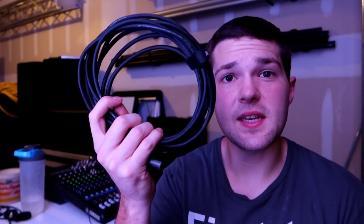Obviously, if you don't have fancy and expensive lights that already have wireless DMX built into them, then you need to go the other route — either DMX cabling, where you run wired cables to all of your lights. So I would run a wired cable from my Show Express box output into the input on this light. Now, there is a big downside to running cables, and that is that all lights have to be chained from one to another, which takes a lot of cables.